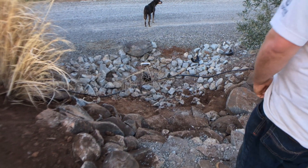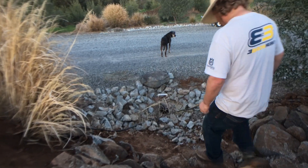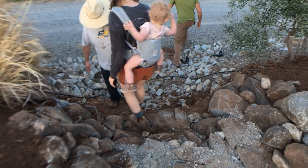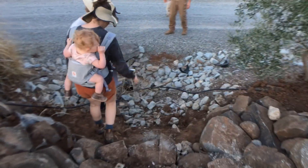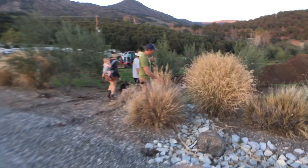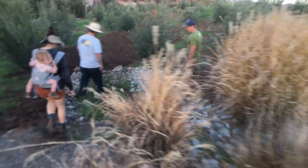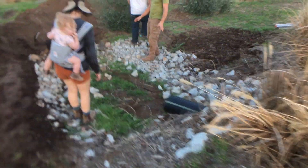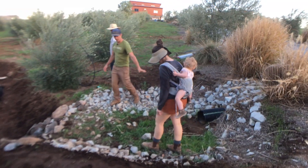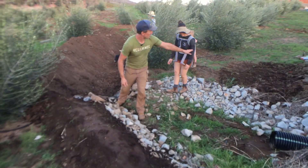From the culvert it'll enter the east olive top swale and run another 250 feet across the landscape. We like creating these fun swale trails on the property to walk through. The culvert runs underneath the driveway and discharges into a slightly remodeled splash basin that was mostly pre-existing from prior patterning — there's some silt and a nice level area. We created this berm here and armored the side.